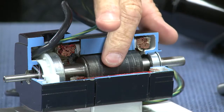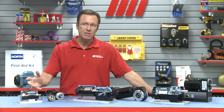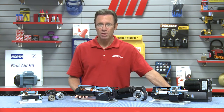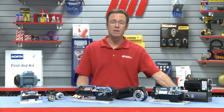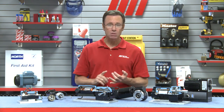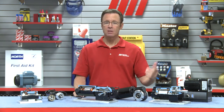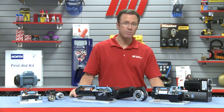Finally, we've got the brushless DC motor. The brushless DC motor combines the speed-torque characteristics of a PMDC motor with the winding design of an AC three-phase motor and a permanent magnet rotor. BLDC motors are virtually maintenance free and excellent for applications that start and stop frequently. All three motor types have their unique benefits depending upon the available power, loading, cost targets, or maintenance requirements. With the right gear head, all three motors can power applications such as medical and packaging equipment, conveyors, and a host of other industrial automation machines.